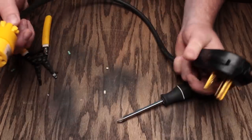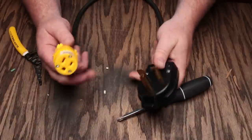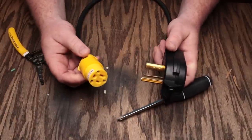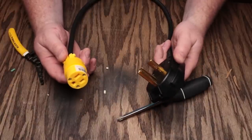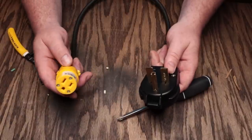And now you have just created an adapter to plug the Anvil Foundry's standard cord that plugs into a normal 120 volt outlet into a 240 volt 30 amp outlet. So that is how you do it — it's pretty simple, not really that hard. As long as you put your ground wires on the ground terminals and your black and white wires on either one of the corresponding terminals, you are good to go. It's just hard to mess up. If you have any questions or comments, leave them below. I don't feel like I'm putting out anything that's unsafe personally — if I thought it was unsafe, I wouldn't do it myself and I wouldn't make a video on it. If you found the video helpful, give us a thumbs up. This has been Brian for Short Circuited Brewers — we'll see you on the next video.